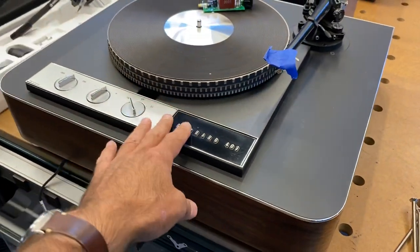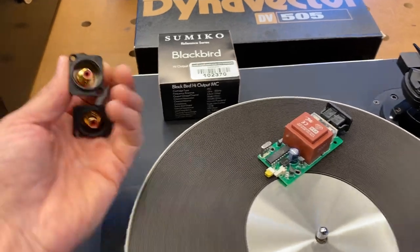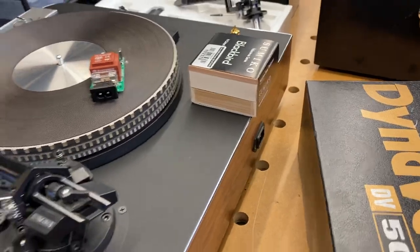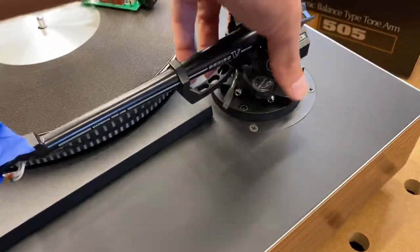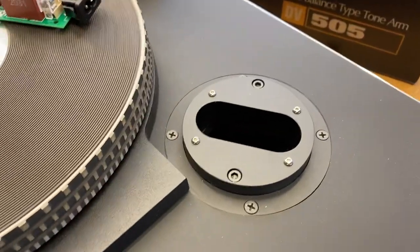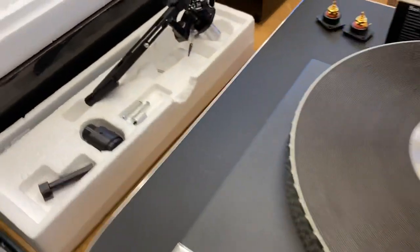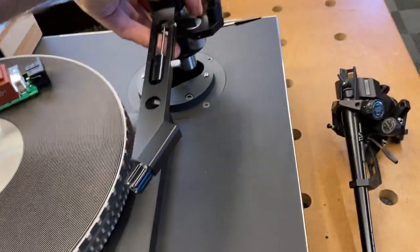This is not a very intensive project for us — it's a matter of just fitting the two together. We're going to do removable RCA jacks; I like to be able to play with wires, so we will cut the RCA jacks into the back of the unit. It did already come pre-fitted with a power cord, so we can play with power cords as well. I haven't quite decided on the tone arm. I've got an SME 4 sitting on it, which is a wonderful tone arm. The mount is an SME — you can tell by the oval shape. But I'm also considering a Dynavector 505, or even the Avis SA 1.2, a beautiful Japanese-made tone arm. I'll probably try them both and see what I like better.